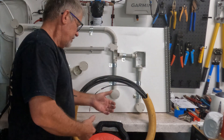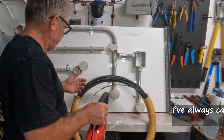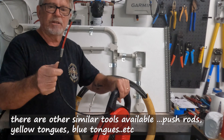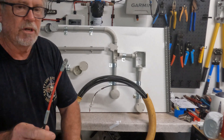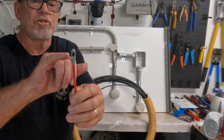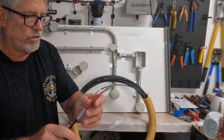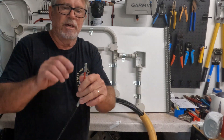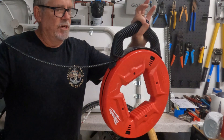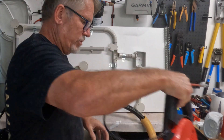What if we can't do that? Simple — we use one of these. I've got two different snakes here. This is a Milwaukee snake. Both of these snakes are fiberglass snakes, very easy to use. These have basically these ends on them — you can tie your cable to it or tape your cable to it. So you push this through the conduits, get it to where you need it, then tie your cable to it and pull it back through. This Milwaukee one might have been a hundred, hundred and fifty dollars from our local tool supplier.